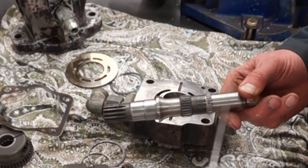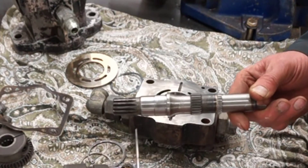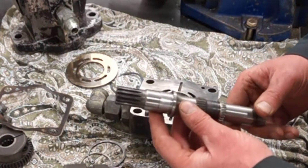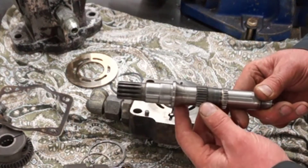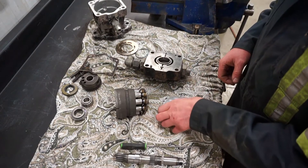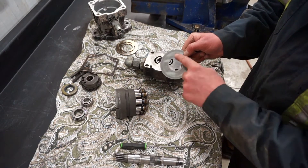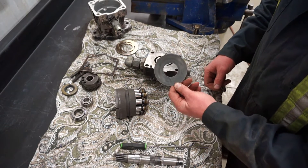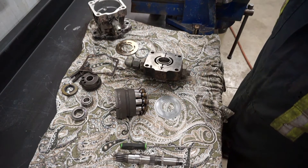On the shaft, you'll probably find a groove where the seal was riding. I welded this up and machined it back down to a nice fine finish. This wasn't actually where the motor was leaking externally, but I fixed it because it had a relatively deep groove. When looking at the motor, you're looking for whether it's just plain worn out — scratches in the parts, the sealing surface. The biggest thing is to concentrate on leakage; if you can control your leakage, that's all there is to rebuilding a hydraulic component.